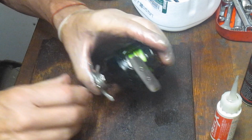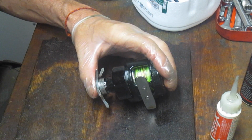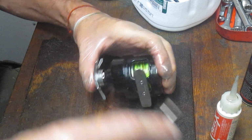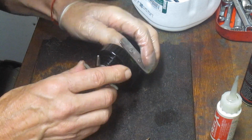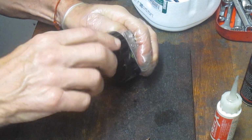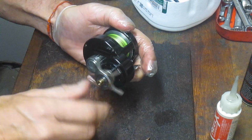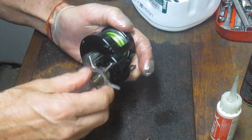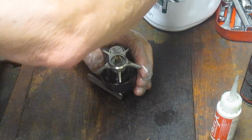And at some point you're going to hit this little stud here for that adjuster. And that's simply just press that in with a screwdriver. That should help clear the case, which it just did. And we can complete the turning of that. Now you got the clicker, you know you're working well. We'll give it a run. Sounds like it's doing just fine.